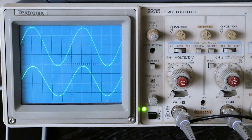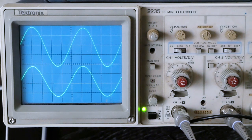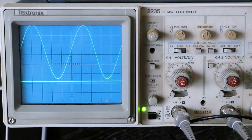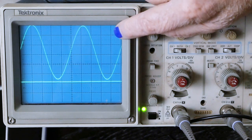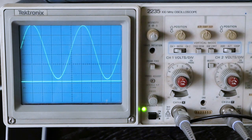We've got the preamp back on the scope, with our sine wave injected at one volt per division. Let's turn the amp down and get our 2 volts RMS in, which is 5.6 volts peak to peak — and that's right at 5.6 volts peak to peak. So we'll switch this back to two volts per division. We've got our 2 volts RMS in.